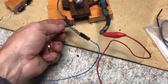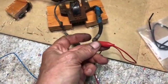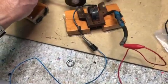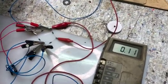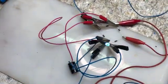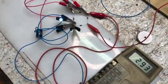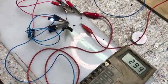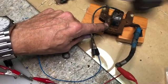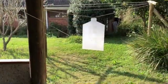The best results I got were from this lawnmower magneto. I connected the wires from the main high voltage plug wire, and if I spin it you'll see it immediately jumps up and gives me two to three volts with the LED shining. That is a very nice result for something off the shelf — I don't have to make my own coils.